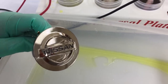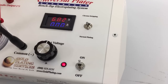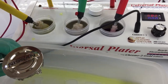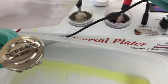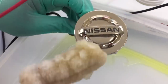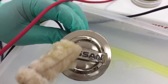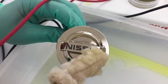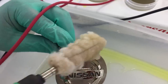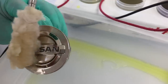Next we're going to move on to the activation. We come over to this switch and switch it to normal plating. That works for these two ports here — the middle and the gold port. We have our surface activator solution and we want to set the voltage to 6 to 7 volts. This is just a quick activation of the nickel. You can't really hurt it if you overdo it, but 15 to 20 seconds is sufficient. You're just activating that underlying layer of nickel and getting it ready for gold plating.